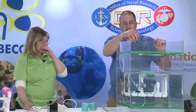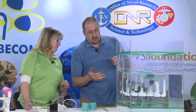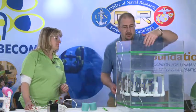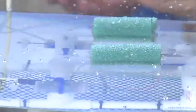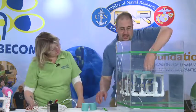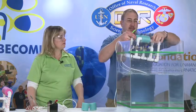So we're still a little bit positively buoyant, or floating. One of the things you can do is take a look at the amount of the float that sits above the water — that's the amount of flotation you can remove off the vehicle to make it neutrally buoyant, or to the point where it will both float and sink very easily. So based upon that, we'll go ahead and cut off just a little bit of one of these floats.